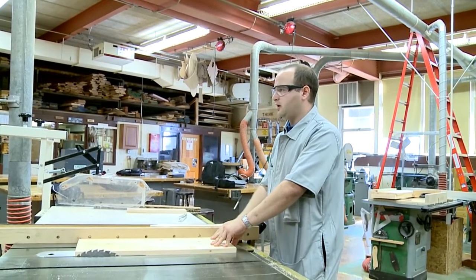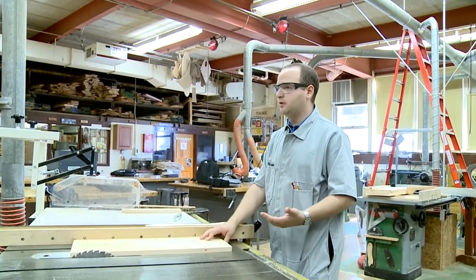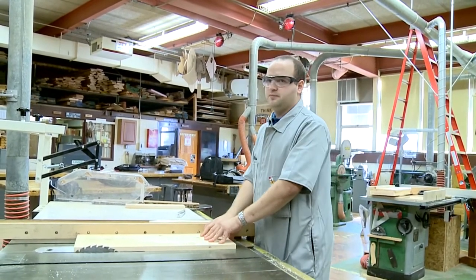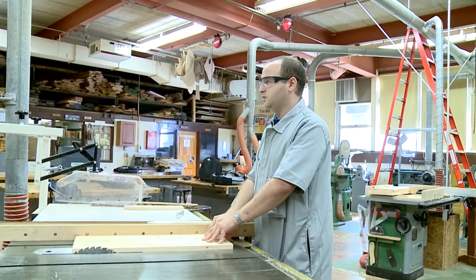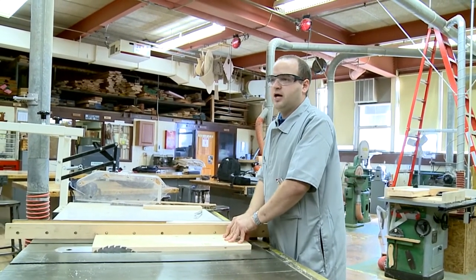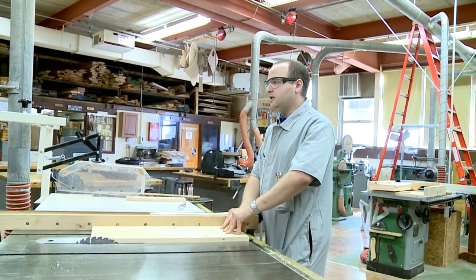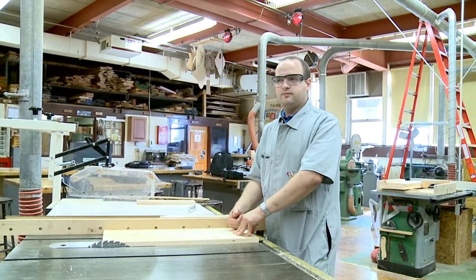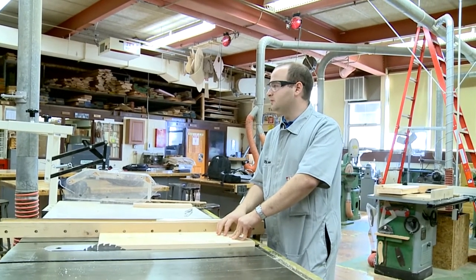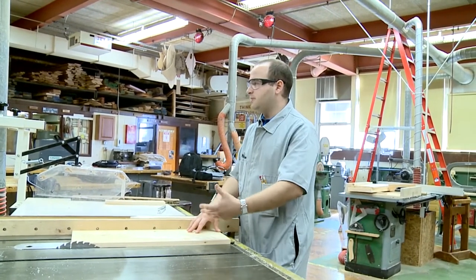So he went over to help. Instead of maybe turning the machine off and trying to figure out what's going on, he was standing, look where I'm standing, directly behind the board, okay, which is first mistake, and he tried to just force the board through the saw. All right. In doing that, the board kicked back. It hit him directly in the groin. And ladies, I'm sorry if you're easily embarrassed, but he was obviously in a tremendous amount of pain.